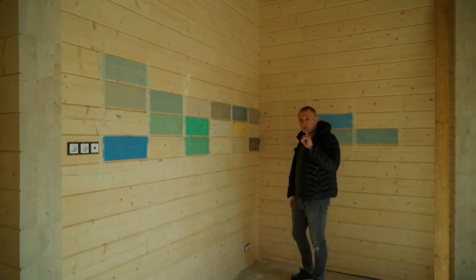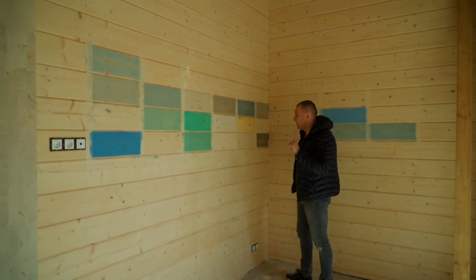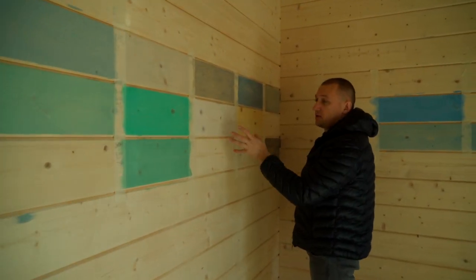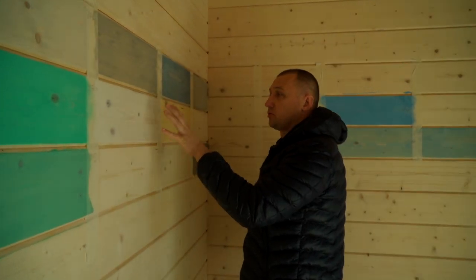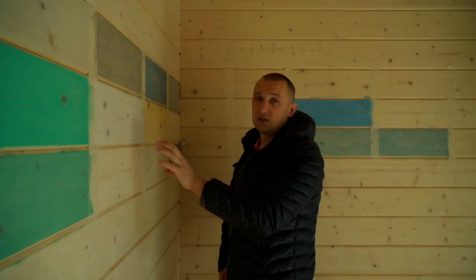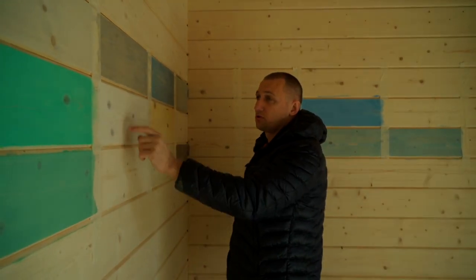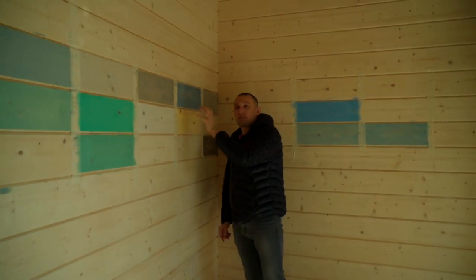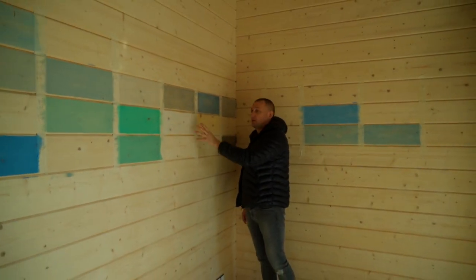To choose the colors for your house correctly, in each room you should paint samples on real walls — they come with different humidity and materials. That's the only way to see the true color you're going to get. No painted samples from the market should be used — only your particular walls, in a particular house. It gets dry, you observe it, you choose the color, and you paint it with an exact color match.